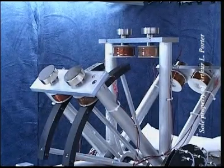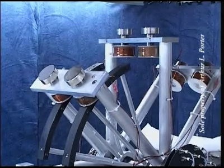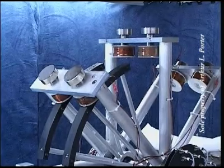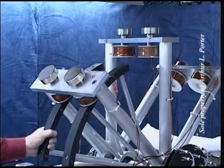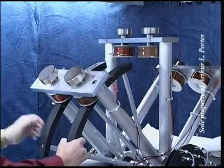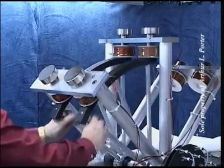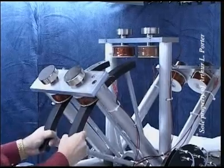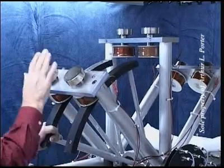Just like on the demonstration table. I'm going to turn the power on to the motor again, but I'm going to hold the armature to prevent it from turning. Actually, I've installed a stop to prevent it from turning in order to do the demonstration. Okay, now the power's on. You're going to notice those coils and a permanent magnet up there are going to really attract it hard. Okay, now I think it takes just over 90 pounds to break that loose up there.